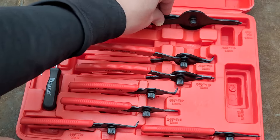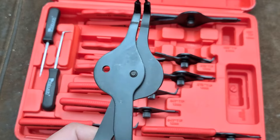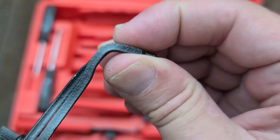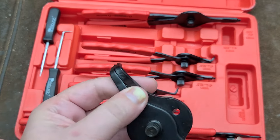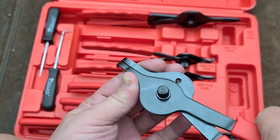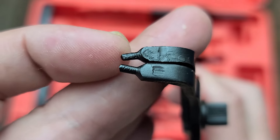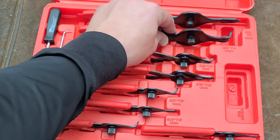These are the sheet metal snap ring pliers. Even the Icon ones, which could be a little bit better material, you're still going to suffer from some of the issues these can have — particularly stiff or rusted, jammed snap rings. These little tines can bend and deflect. What really wears out is the edges on these little pins. Fortunately, you can grind the pins down a couple of times, just like Torx bits, in order to get a fresh edge.